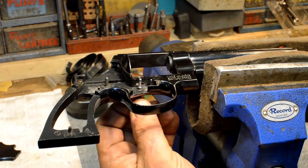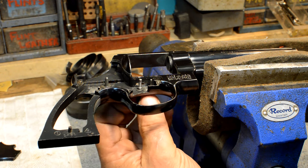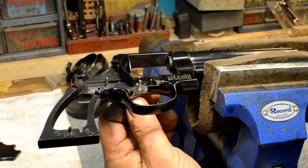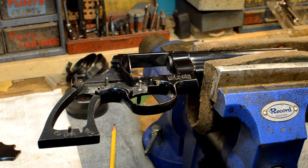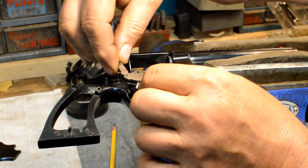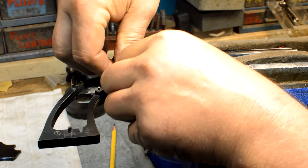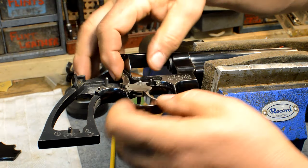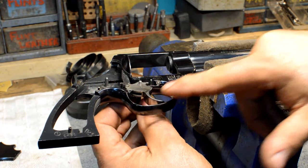All right, I used an 8-40 thread pitch, and you can see it's walking around a little bit, because my intention then is to fill the rest of those threads up with a red Loctite and lock that down into position. The rest of this is just gonna be a matter of hand fitting all of this. We'll check it here, but we're gonna set that over its trigger stud there. Bang, we're back to where we need to be.